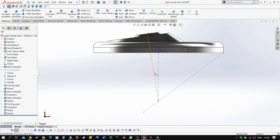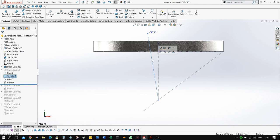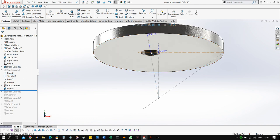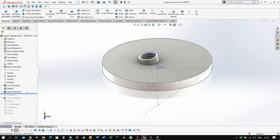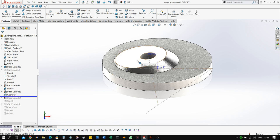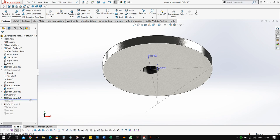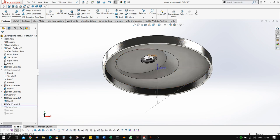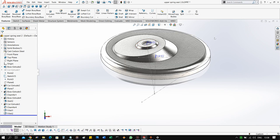Then comes the upper seat for the spring. Just like the lower seat, it has to be flat on one side and at an angle — which is the steering axis — on the top. This axis is where the piston will travel. We add a box extrude, add reference angles for the steering axis, then create a hole through which the cylindrical shaft or piston will move. At the top, add another section: a cylindrical part at the steering axis angle, then chamfer the edges. Then shell this face to remove all material from the inside, cut extrude the additional shaft protruding outside, and add a final chamfer and fillets to remove sharp edges.